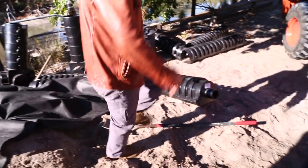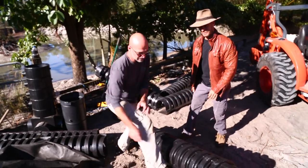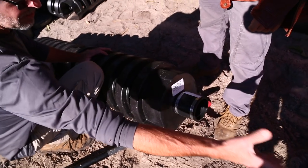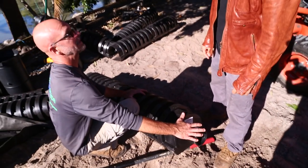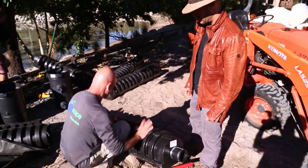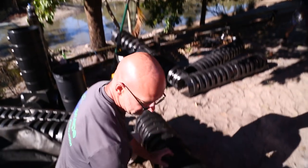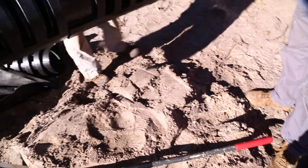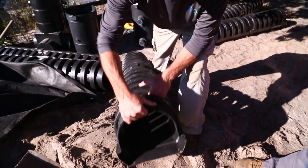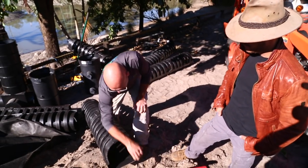These are the centipedes — they've got great names. The incoming point for the water from the pump is a three-inch connection. We're going to have high-velocity water coming inside, flowing probably seven feet per second — that's pretty fast. It's going to blast inside, and we have a 93% reduction in water velocity, so we slow that water way down. This chamber on the bottom is designed for sediments; the heavier sands and things like that will accumulate down there.